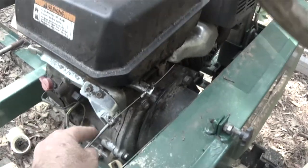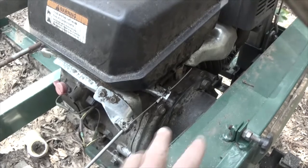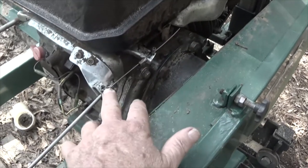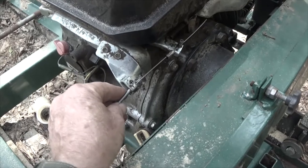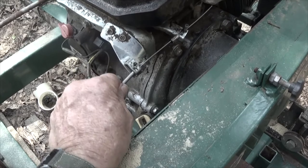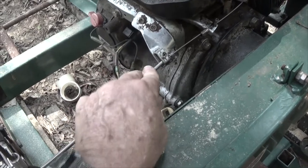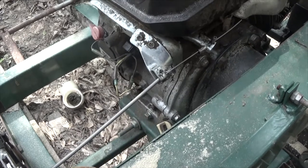I'm a Dysfunctional Vet with a throttle repair to the HM126 sawmill. This piece right here has a hole in it to drive the screw — it holds the throttle cable. This right here is a cinch down. The cable that they sell is armored with a plastic sleeve, but due to this COVID foolishness, I'm unable to get one of those cables at this time, so I went back with a lawn mower cable.